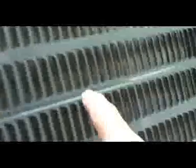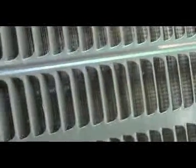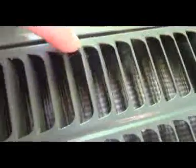And then this one's fairly clean, but if you look up inside there, you're going to see a bunch of spider nets. You know, they usually fly around. See, like that right there, there's usually thousands of them. And they'll get inside on your coils and they'll restrict the airflow that these things need to keep everything cool and to make your unit work properly. This one's in great shape, but I'm still going to clean it out.